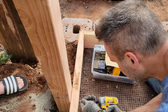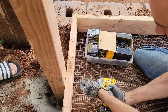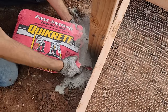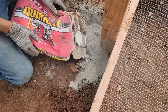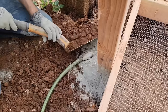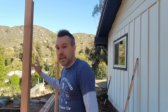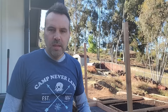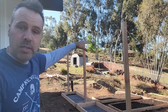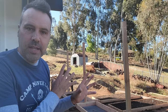I had Noah and Emily helping me. I screwed it to the wood of the raised bed to make sure we got that level perfect and it stayed perfect. Then I went ahead and filled the hole with some quick-setting cement — you can put it in dry up to the top of the hole, right above soil level — and then I built a little berm of soil around that and filled it with water several times to let it percolate down through that quick-set cement. This morning it was perfectly, perfectly strong — not only hooked to the bed with screws, but protected and even more stabilized with cement in the ground. So we've got the beds and we've got the uprights; now we actually need to build the trellis structure at the top. I'm going to start cutting some lumber and then I'll be back with all of the pieces to show you how it all fits together.